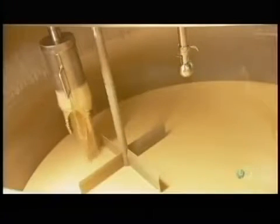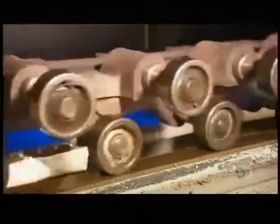The batter then flows out of the blender and into a refrigerated tank. At this point, the blend is the consistency of pancake batter, and an agitating blade keeps it that way. Next, nozzles deposit measured amounts of batter on a baking plate that looks like a moving waffle iron. Top plates flip down, and the baking plates roll through a gas-heated oven for a quick bake. The top plates lift up, revealing the cooked waffle patties.